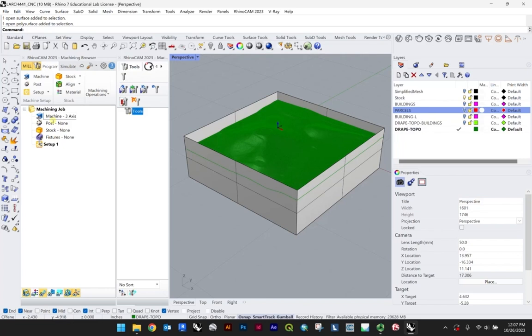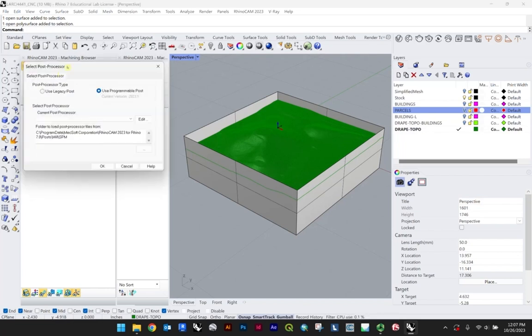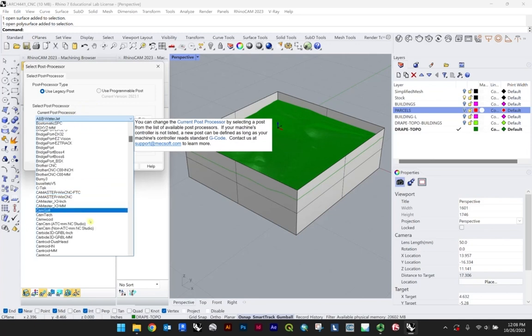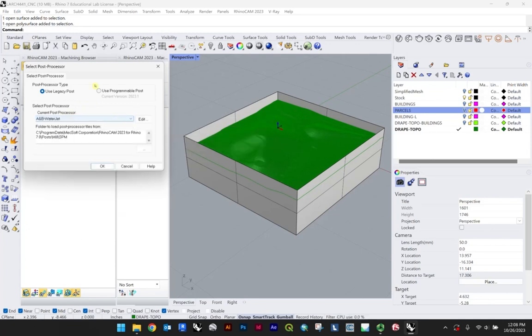And then similarly, when you're in the lab, the post, you're going to want to set this up. And so here you can select post. Now, we're not going to have the post selected here, but essentially, if you go programmable, I believe on our school's machines, it may be one of these two, but in any case, you'll get a drop down, and specifically what you're going to be looking for is a post processor. It's going to be bracket UWABS, and then you're going to either choose small or large, and that value, which again won't be loaded onto here, the differentiation between the small and the large, just means if you're going to be using the small milling bed or the large milling bed.